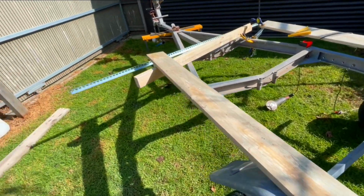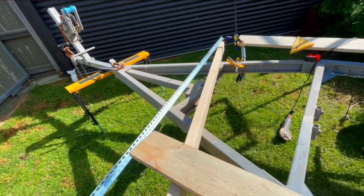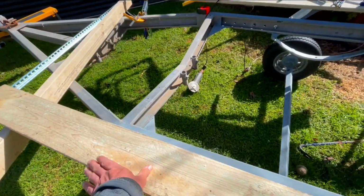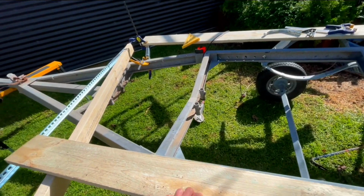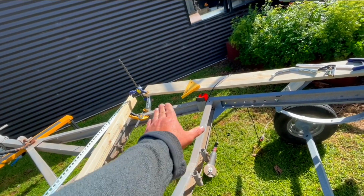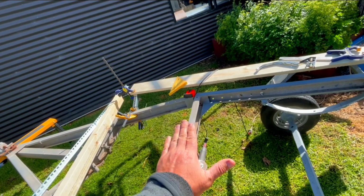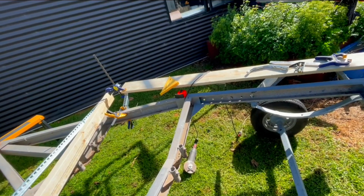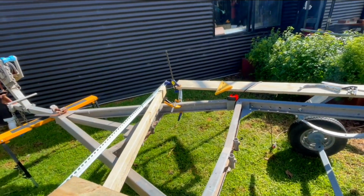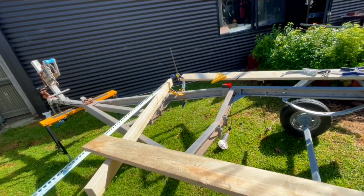I've got this flexi strut stuff that I'm going to use to try and make some brackets to hold the bunkers up. So these are the bunkers that the pontoons sit on. You can see one over there I started. So I've just cut a section out of it, bent it down to almost 90 degrees, not slightly above 90. I want these bunkers to sit with a bit of an angle so that the pontoons slide inwards, not outwards. That's sort of the arrangement. It's about right. I think that's about where it's going to end up.